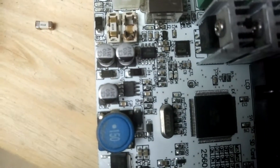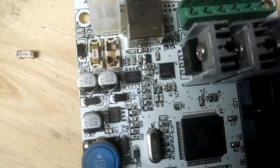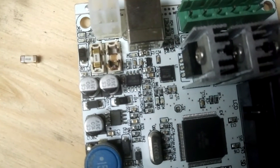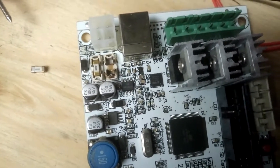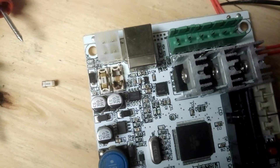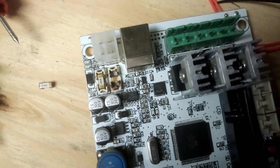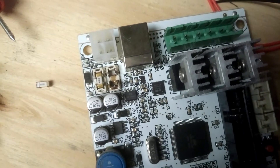Then I noticed these fuses. I did some googling over the weekend about heat beds dying, and there was some mention of resettable fuses, so that's what got me looking. But I don't think these are resettable - these are just the blow-once kind, sort of mini or micro fuses. And it's a 15-amp rated fuse that's blown there.